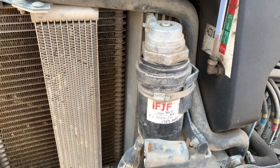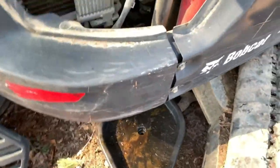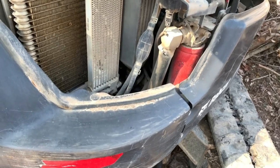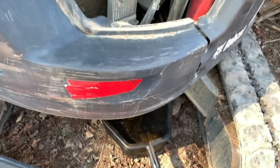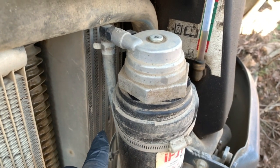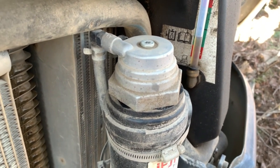The new fuel filter looks just like the old fuel filter. Now is the time to mark the new date as well as the hours. I'm going to put a catch pan right underneath the area where the fuel is going to come out. The way this is designed, there will be some spillage — there's not much you can do, you just try to catch as much as you can. At no time while I'm replacing this filter will I remove these fuel hoses; there's no need to, and it's better that way to avoid any risk of contamination to the fuel system.